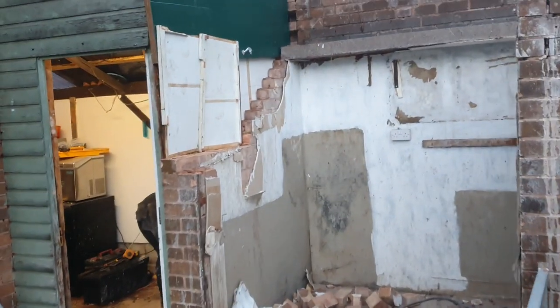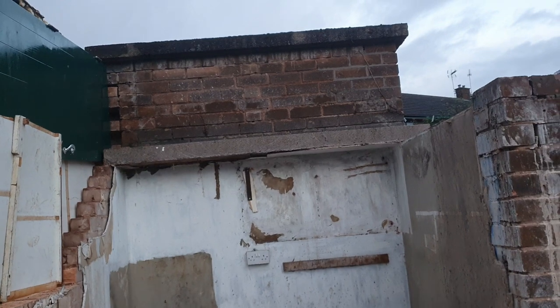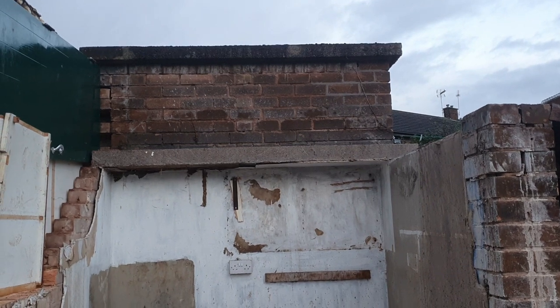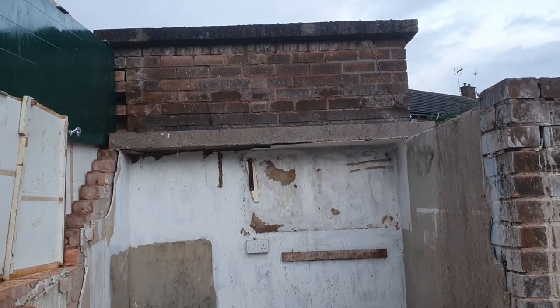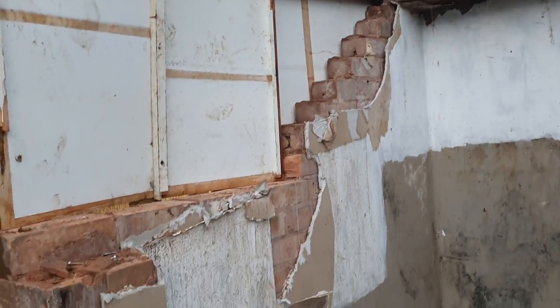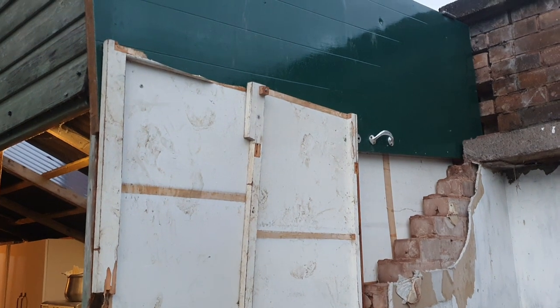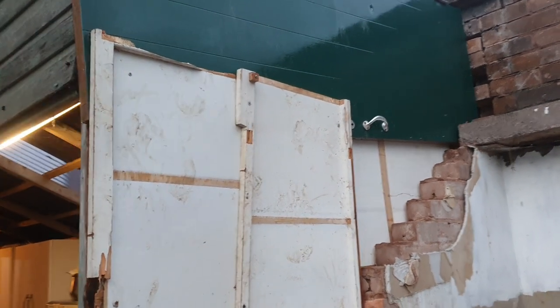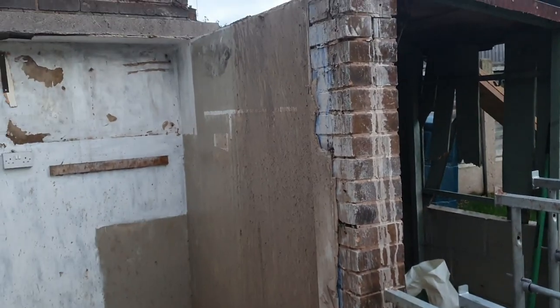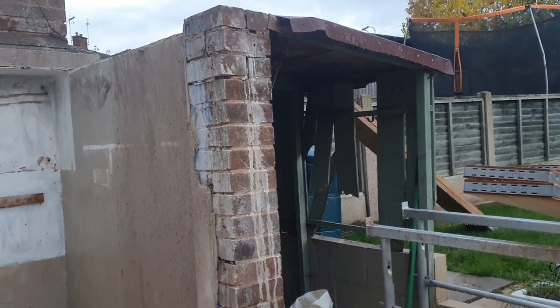Day one — oh my God, it looks like a Steptoe's yard. But we've got it down. There's the roof, all in nice manageable blocks — I say manageable, they're about 40 kilograms a piece. We've just got that back piece there to cut out; it's haunched into the back of the opposing unit, so we'll just have to take some header bricks out, squeeze it forwards, chop it up, and then point the bricks back up that we've taken out. Not a problem. These walls are single skin. This one didn't have anything supporting it, so I've knocked down the majority of it just so it's safer and not going to collapse on anyone. And then I've just used the doors and whatever other bits of timber to keep it windproof, not really weatherproof. That one's got a pier that seems solid enough, so that'll be all right — and of course it's got the timber structure at the back of it kind of supporting it.